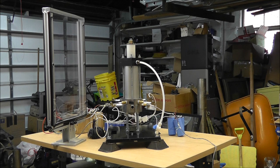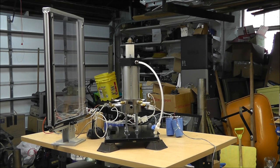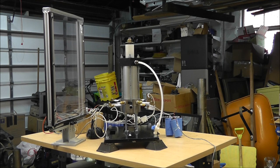See if it was a fuse or what. Okay. I'm going to turn down this voltage a little bit. I had it up pretty high. We're at 79 degrees. Went my breaker again. That's just because I'm pulling too much current through my transformer, trying to charge these capacitors really fast. I need to turn it down a little bit. 82 degrees.